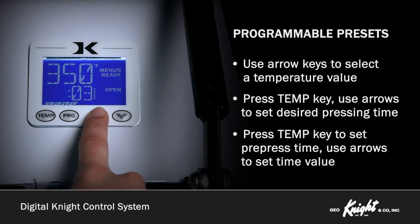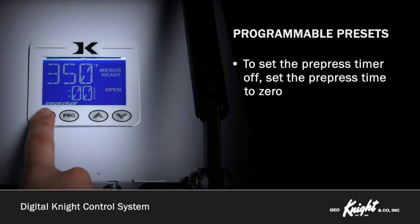This will set the pre-press time. Use the arrow keys to set the pre-press time value. To turn the pre-press timer off, so only the primary timer counts, set the pre-press time to 0.